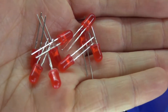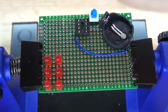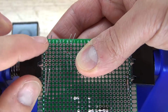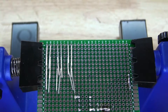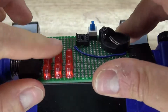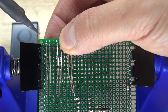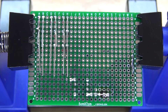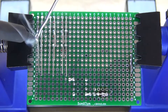Next it's time to place the LEDs. I'm going to start with the red ones first. I'll place them all onto the perf board, aligning all of the cathodes and anodes together — all anodes and all cathodes will be connected. Push the LEDs and bend the leads over on top of each other so they can bridge together. Solder just one pin of the LEDs, then push them flush with the board by remelting the solder. Solder the second pin into place and make sure all the leads are connected in parallel. Solder them together and it should look just like that.